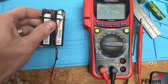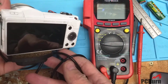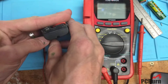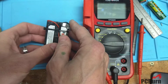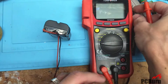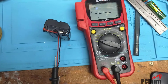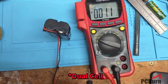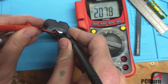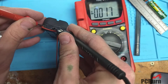Welcome back to the workbench. Today I just killed the battery on my usual camera, the Alpha 5000, and I noticed I need a new battery. So I wired this one up quick — just shot some cables on there with some solder — and I assumed it would start working, but I noticed something weird. It's a 7.4-volt lithium cell, nominally charged to 8 volts, and when I check the leads it's showing 2.078 volts, which is a very strange voltage to be getting.